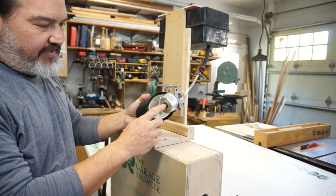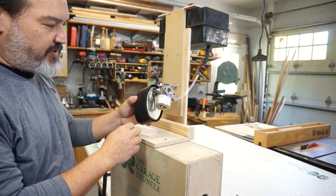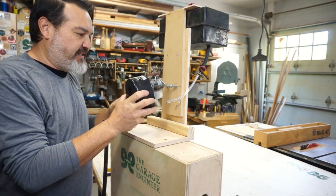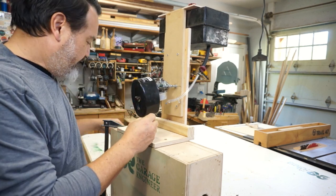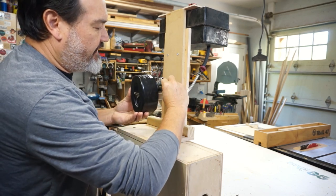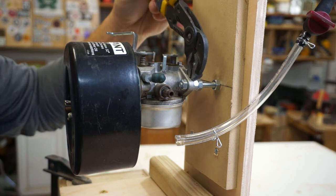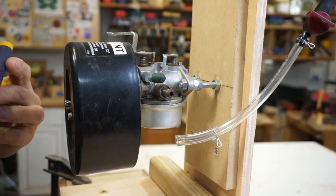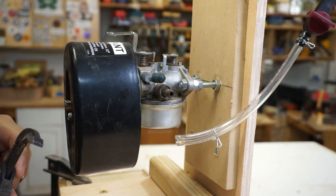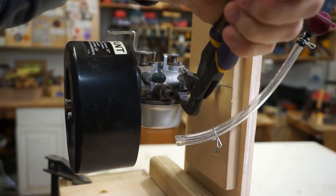This is the carb off the wood chipper. Here's the leakage we're going to be looking at. The bolts are quarter-twenty bolts drilled through the back. We add a nut here just to hold it on so it's not flopping around. Back here I put two locking nuts just to stop it, and here's the one nut we've been using to lock the carb on. We'll just tighten that up a little bit so it doesn't wobble around.